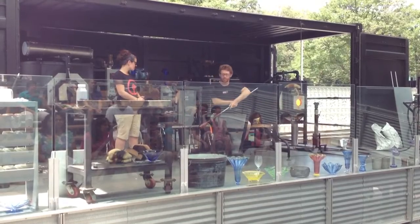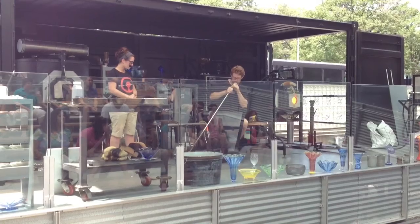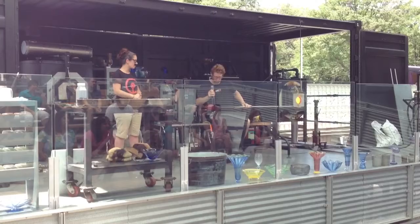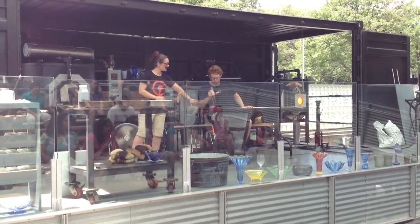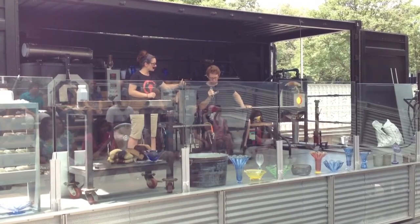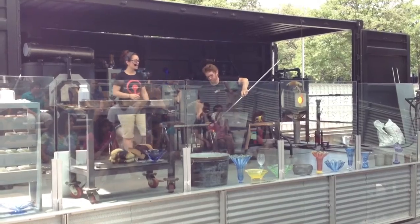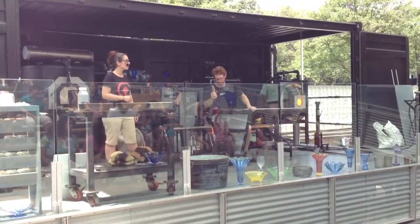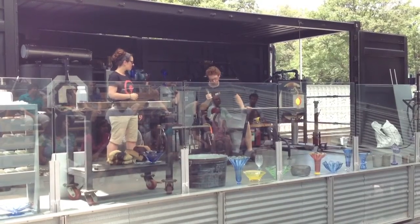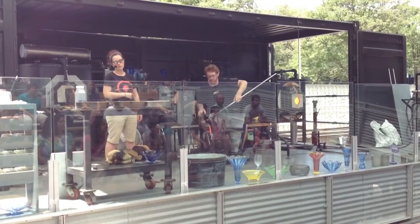All these different hand tools that we work with take a different amount of temperature from the glass. So Dane will use the right tool for the job, depending on what step he's at. But he'll cool the nose of the bubble, blow into the blowpipe, the sidewalls will expand. The top portion of the piece closest to him, that will be the shoulders of the piece. These tools here are called jacks, and he's working in a constriction line right off the end of the blowpipe. That constriction line is later on not only going to be the lip of our finished form, but first it will serve as our breakout point for the piece.